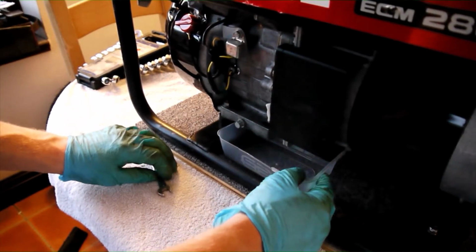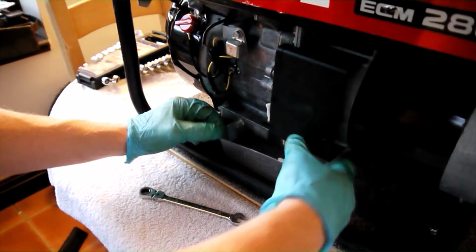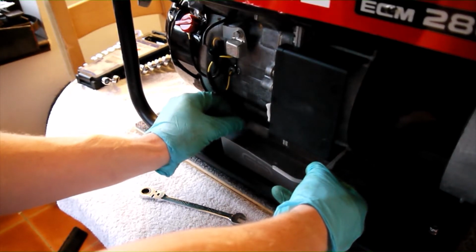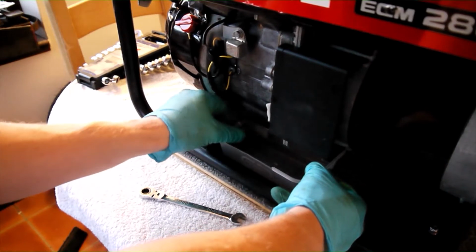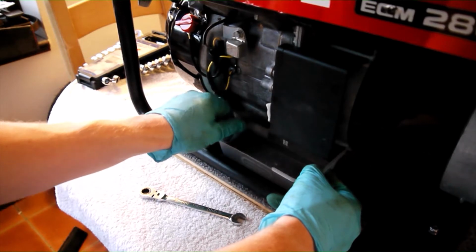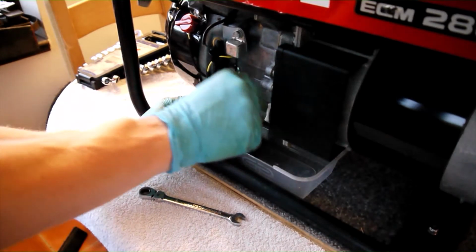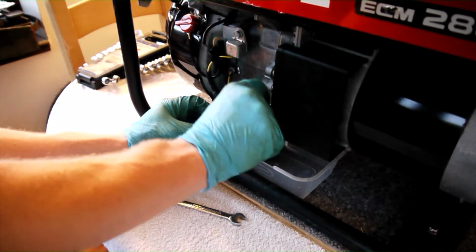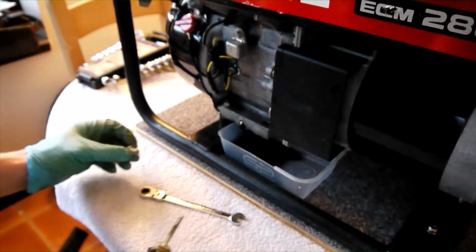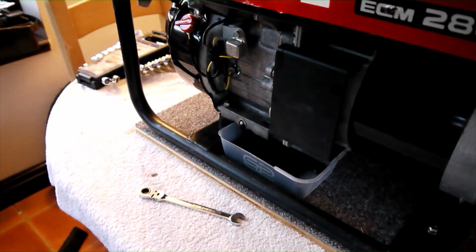I always start by draining the engine oil. This way, we can complete the other maintenance items whilst the oil drains from the sump. A used food container makes a great container to catch the oil in, and it can be slipped easy enough under the engine with the top lip cut away. Once the container is in place, you can remove the sump plug with a 10mm socket or spanner, then release it by hand. It's also advisable to remove the oil filler cap. Doing this will allow the oil to drain faster. It's also recommended to change the engine oil when it's hot, as it will have a better chance of removing any sludge or debris that has built up in the sump.